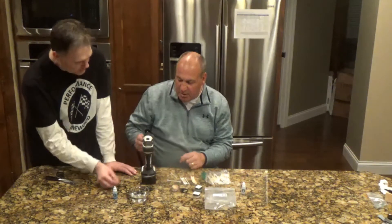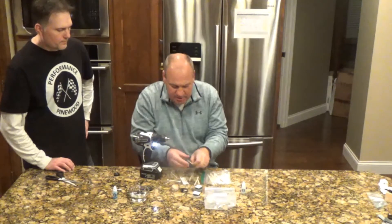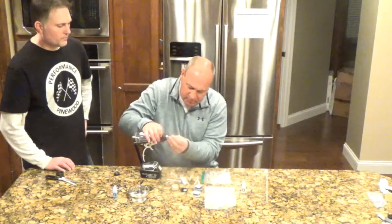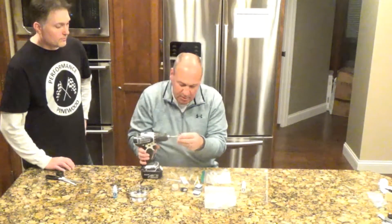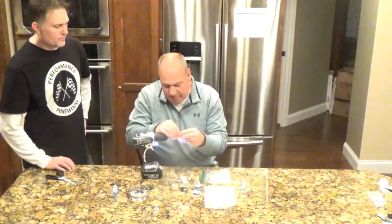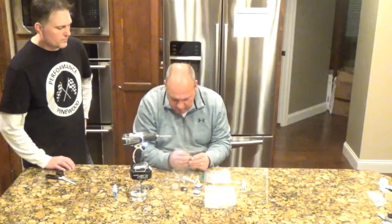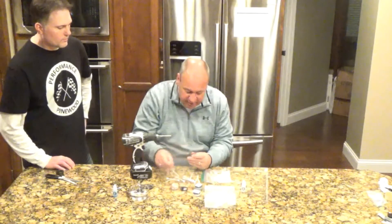You're getting all of this on the outside and all this on the inside. When that step is done, you've got excess polish left in there. Remove your hobby swab and take your fluffy pipe cleaner — these can probably be cut down to go a little further — and chuck that up in your drill. You want to work this in very gently because that wire will scratch that bore. Give it about twenty seconds this way, flip it around, and work that pipe cleaner in there gently for about twenty seconds that way. When it's all done, take these Q-tips and hand clean those bores with their remaining polish, working all those surfaces. Dig it in as hard as you can to clean those and get them very polished.